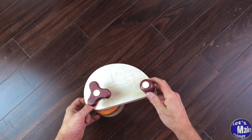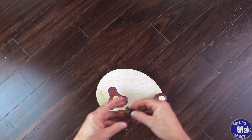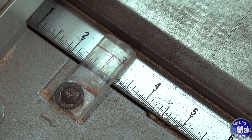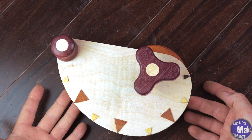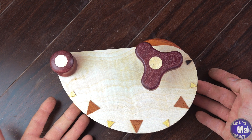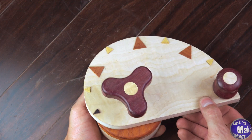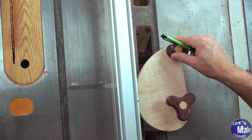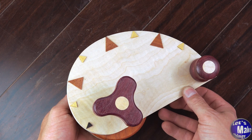You really don't have to make your own knob. You can buy a store knob — a cabinet knob even — and that will work just fine for this. I like that when I use the jig I can watch the measuring tape to get precise adjustments. But you can go a step further by adding a few measurements to the top of the jig. I think inch-and-a-half marks could make it a little more useful as it does give me some kind of starting point. To do it you can add a ruler to the top of the table saw and move it slowly, making a mark at each point. But it's really entirely optional.